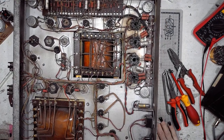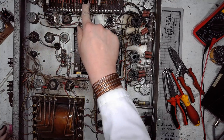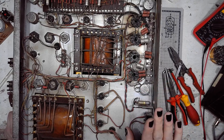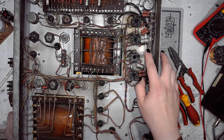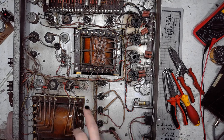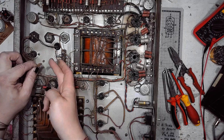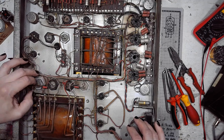And let's look at the wire harness and all the electronics on this thing. We've got some nice film capacitors, none of that paper and wax rubbish. A light bulb. MLT resistors that have been probably replaced. This does not look like the original. Looks like a Ducati capacitor. But it does not look like the original either. The wiring seems to be original. This does not look good at all. It was probably connected to this capacitor.